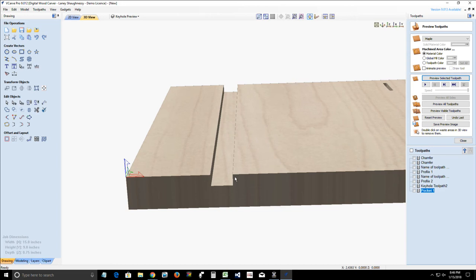And as Steven said, is a half inch end mill not a choice? No, he's got a mini. If I'm not mistaken, Steven has a mini carver. You can use a half inch end mill with a quarter inch shank. He can go to Home Depot or Lowe's and pick up one of those, so it'll fit in his router. That's not a problem, but a half inch end mill with a half inch shank he can't use.